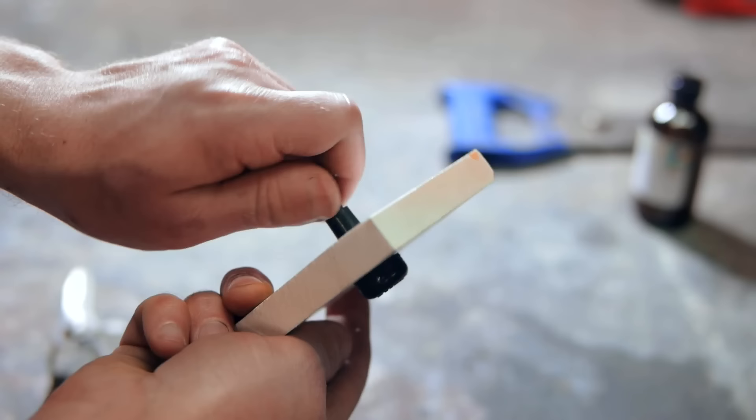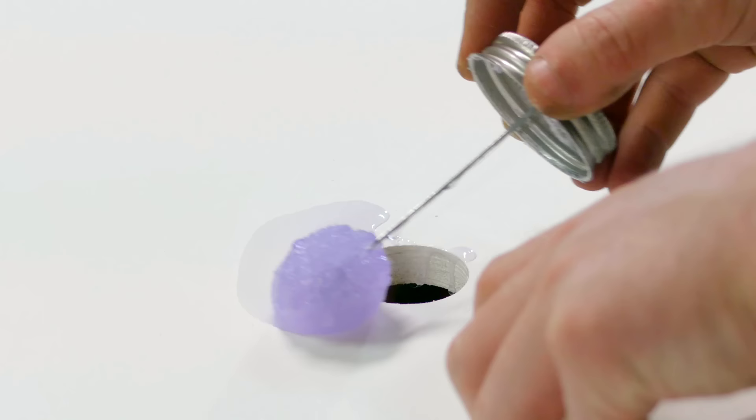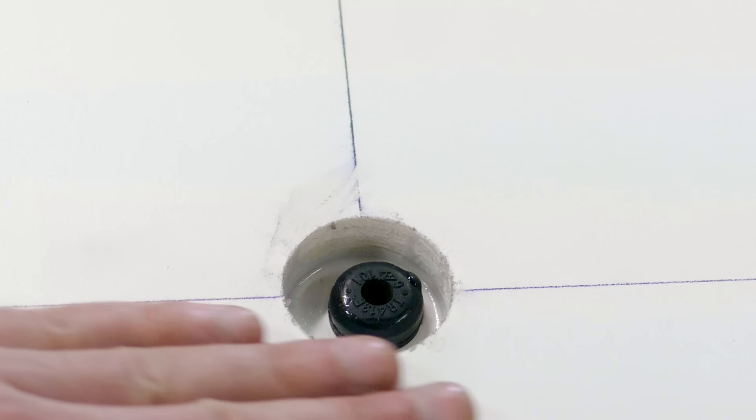I then drill quite a large hole into the center of my base plate. With some PVC cement, the scrap that I mounted the tire valve in is attached with the valve stem facing outward. Once I flip over the plate, you can see why I've done things this way — the valve is sunk below the surface, and I won't have to worry about it getting in the way.